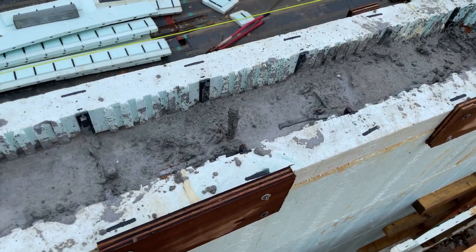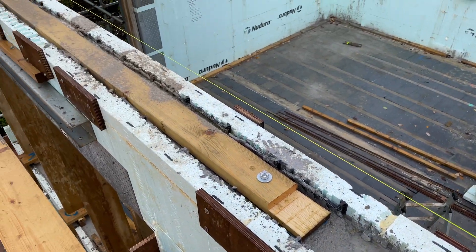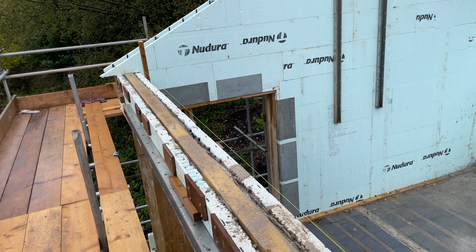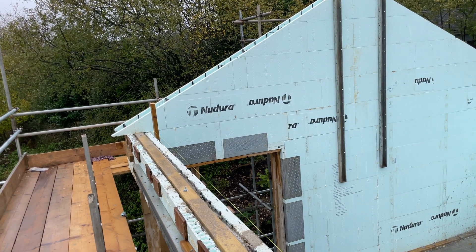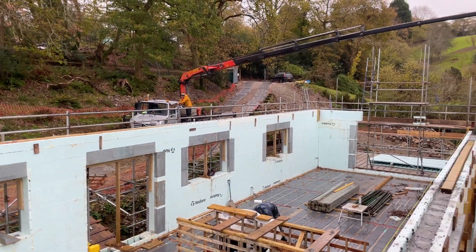This is a couple of days after the pull and the wall plates are going in with a lap joint there and bolted in, and that's what the trusses will be attached to on both sides. So obviously over there down to there and across to here, and they'll be lifted on by the Unimog today. That's where they are, and that's where the Unimog is.